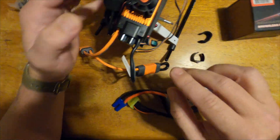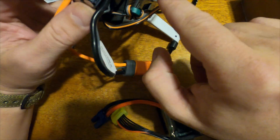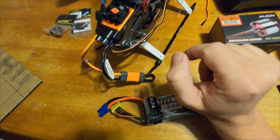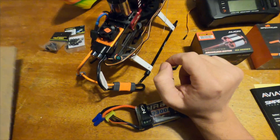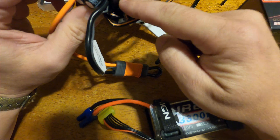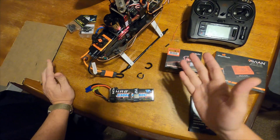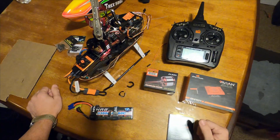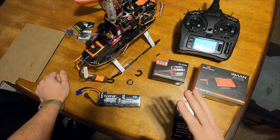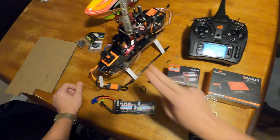The only other problem I have is that the battery release is under the capacitors. So what I'm going to do is take a little plexiglass section and cut it out so that the speed control sits up high enough. In the meantime I've just got it mocked up with wires, and here we're going to power it up for the first time and see if we can pull real-time RPM data out of the motor.